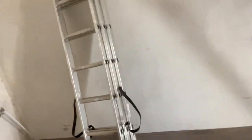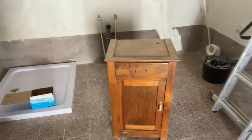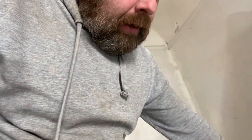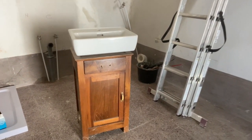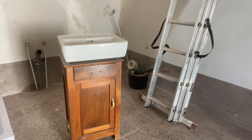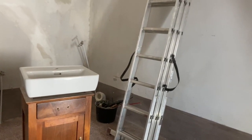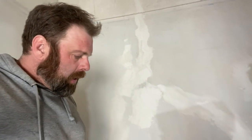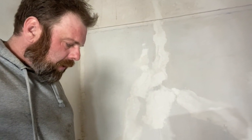The plan for today is to convert this old nightstand into a sink stand. Because it's quite a small bathroom, a lot of people have converted larger bits of furniture into washstands. But my plan is this — it's almost perfect. This was in the house when we arrived, so it's old, it's quite simple, but I think it'll be quite nice. What we have to do is block off the drawer, cut the holes in the back for the pipes, strip out there, cut a hole in the top, fit the sink, silicone around the outside, clean it up, and then screw it to the wall. That's the plan — some upcycling we're going to get going.